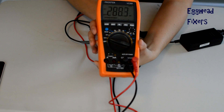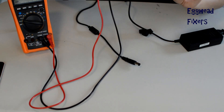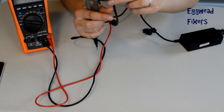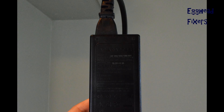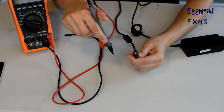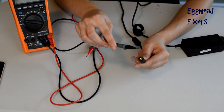Once you've done that, it's time to gather up everything you need. You need your red and your black tester, your charger end — and it needs to be plugged into the wall — and you need to take the block and look at what voltage it says it should be putting out. For example, this reads 18.5 volts, so it should be near that if it's a good charger. It should be either maybe half a volt higher or half a volt lower — that's well within the margin of error for a charger that's working properly.